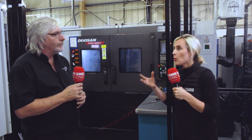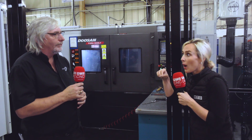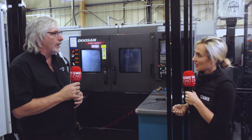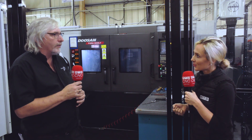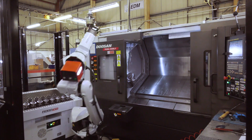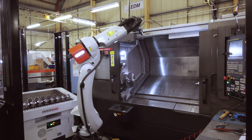You mentioned you're machining and manufacturing parts in a different way now — can you explain that? We're changing the technology a little bit with the types of carbide we use and the parameters around how that carbide is used, to produce chips rather than stringy swarf.